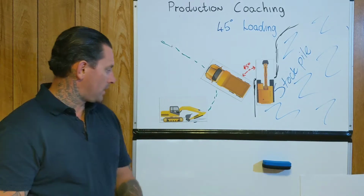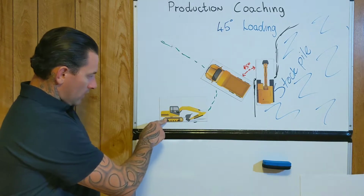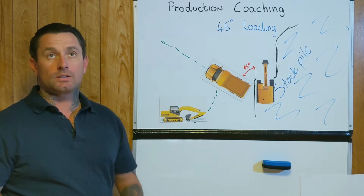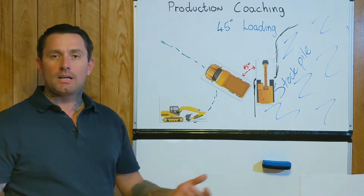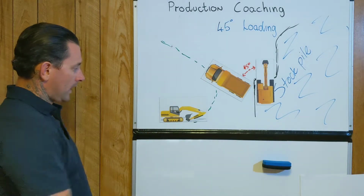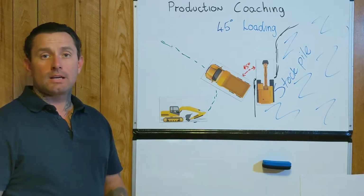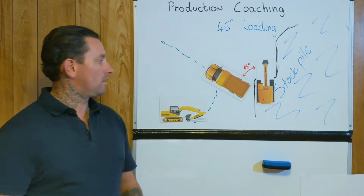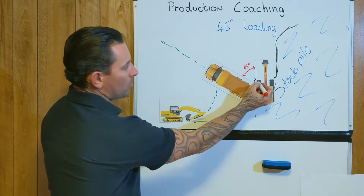So we'll go to an excavator up here, and when the operator's talking about an idler, you've got the drive sprocket. The sprocket is not exactly the same, but it's almost like a bike sprocket for the chain. So that's your drive one. That actually drives your tracks. And right on the front, you've got your idler wheel, which doesn't have the teeth on it to drive. It just roughly guides the track, and that's what they're talking about with the idler. You can see it here. The idler would be up here somewhere.